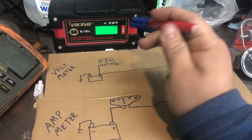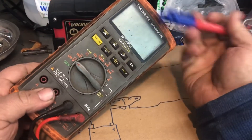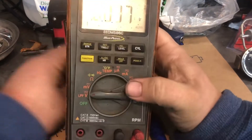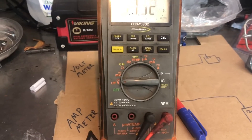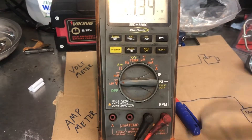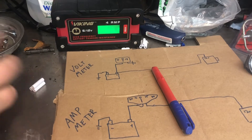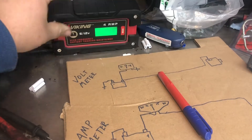So that's how you read with a voltmeter. I'll go up to this battery here with this tool - see, 13.6 volts. I don't know if you can see that, but it's because that battery is currently sitting on a charger. We could have also known that because this charger says 13.7, so it's on a trickle charger.